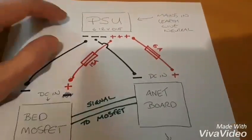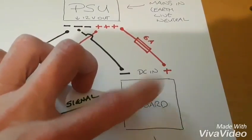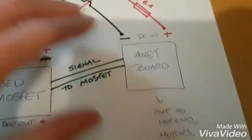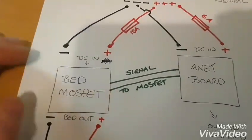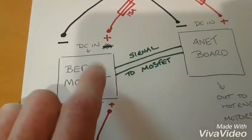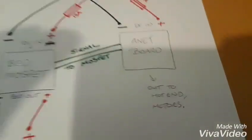So, looking at the wiring diagram: power comes in from the mains, 12 volts out. On one side you have your 6 amp fuse going to the Anet board with a corresponding ground — that then feeds the hot end, the motors, and so on. On the other side you have a separate power and ground, with a 15 amp fuse on the positive going to the DC input of the heated bed MOSFET. The green wire is just the signal line — we are using the original on-board MOSFET just to trigger the new, more powerful external MOSFET. When it gets a signal it bridges the circuit and passes current down to the bed. So you have a fuse on the bed and a 6 amp fuse on the board for the motors.